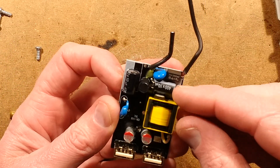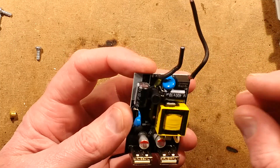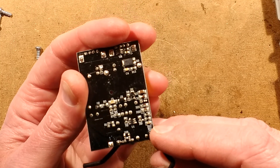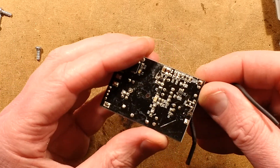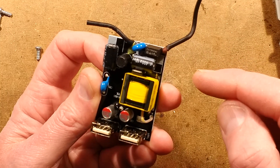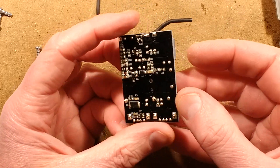There's the 400 volt 10 microfarad capacitor. So they have this 400 volt capacitor which got charged up to 500 volts during the test. They've got filtering - a capacitor across the input. There's a little tiny bridge rectifier - I've never seen one like that style before. We've got the supply coming in, going through a real fuse, it's got a suppression capacitor, the rectifier on the back, then the smoothing, then the inductor and more smoothing.